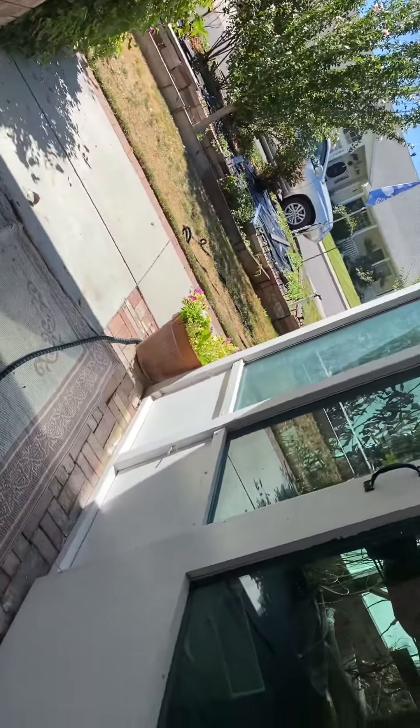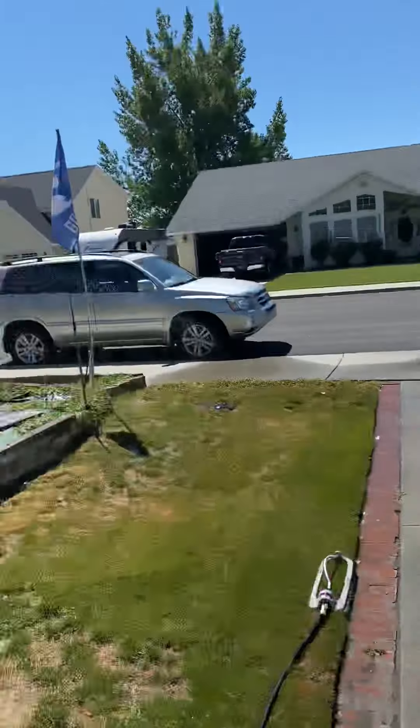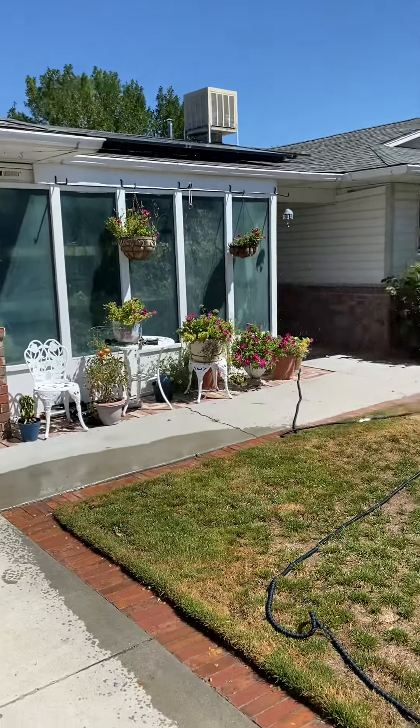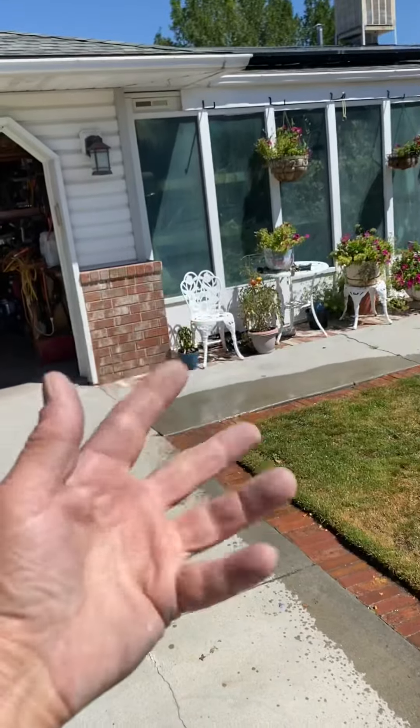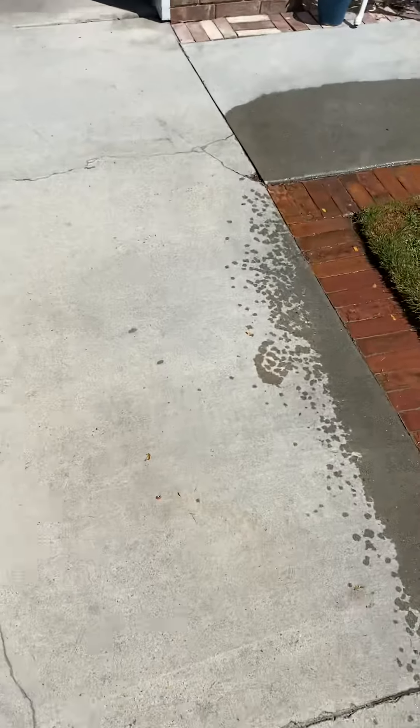There's a swamp cooler right here. We're going to leave this inside, but outside we're going to take the swamp cooler off. It's so old you could probably just drop it off the roof. I gave you a 17 and a half by 17 and three quarter cap with two inch liner on it. I also gave you a two by four box with a flat cover — just screw the box on the inside and wire nut it in there, then put the flat cover and put the end cap on. Seal it and I gave you some Sikaflex — seal it as best you can.